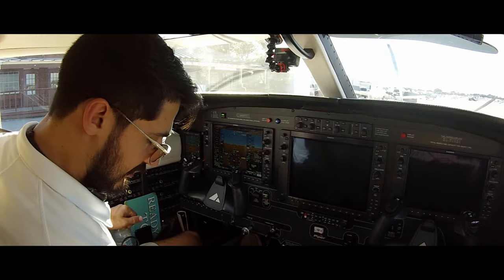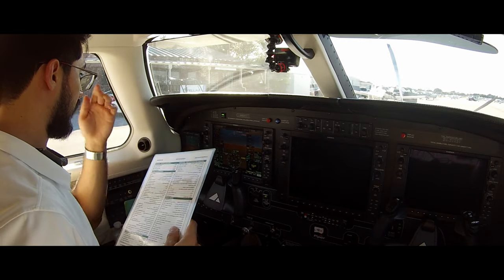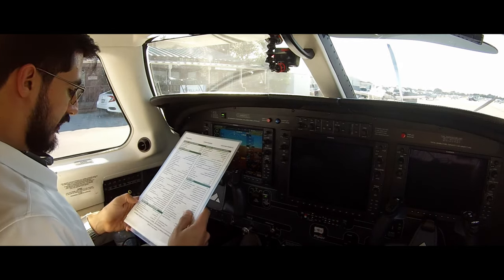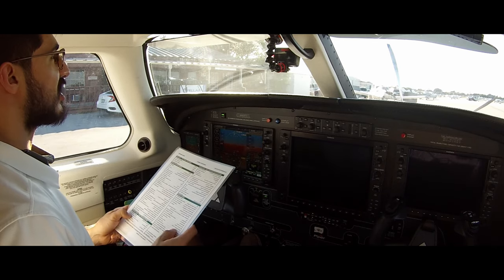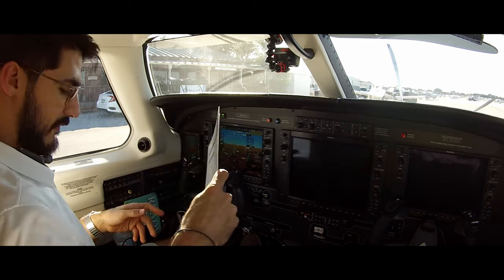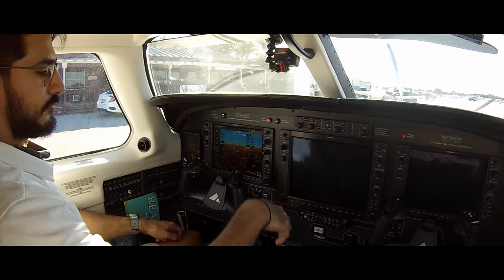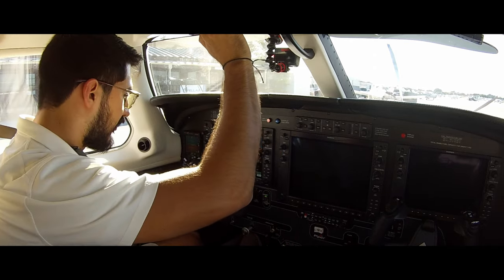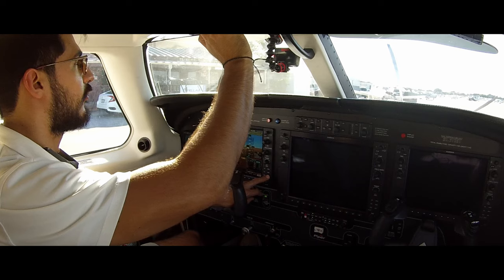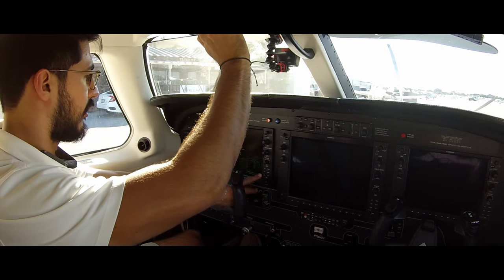Fire. We can clear that. Battery voltage between 24 and 26. We are at 25. We're gonna flush out the heat first, so we want manual mode. Fuel pumps are off, ignition is off, and we'll start a timer for 30 seconds. TAWS system test, okay.